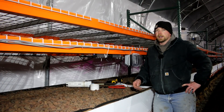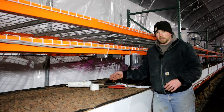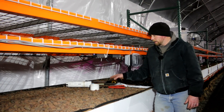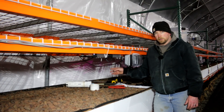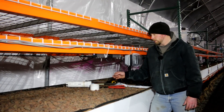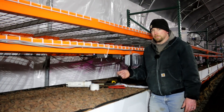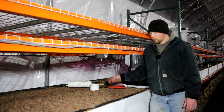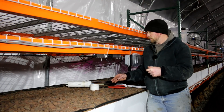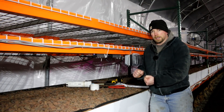The PVC isn't cut to length yet — I needed it long so I could set it. It's really tight in there and hard to maneuver, and underneath is equally tight. I'm actually thinking I like the idea of using the existing drain location and adding a secondary hole, because then I can put the bell siphon cover over the top, creating a siphon to really drain everything out in an overflow condition rather than just having water trickle in and out at the same flow rate. But I also need a second pair of hands to hold it up top while I crank it down from the bottom to cinch the gasket seal.